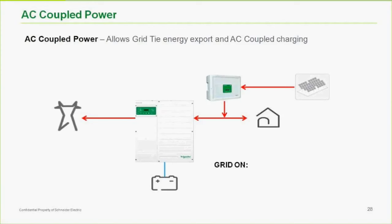So ideally, for rest of world, for single phase, we have the RL. For three phase, we have the CL. That's actually 480, higher voltage, so you have to use a transformer. But for North America, for AC coupling, I'm not the only one. I don't like recommending other companies' products, but when it's appropriate, I will. For North America, if you must AC couple, Sunny Boy is the way to go, because they do respond.